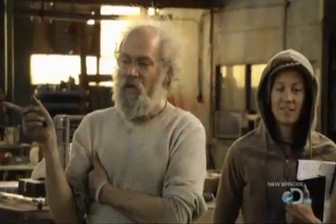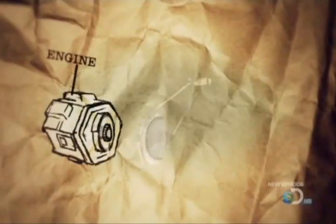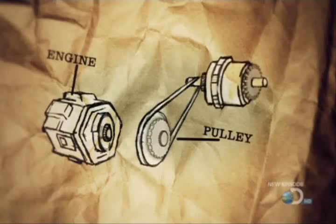Batteries are getting really low, Mike. I think we've got to come up with some sort of generation. I'm thinking about an idea to run a small engine and run an alternator. A simple generator can be made from a small engine, a pulley, and a car alternator.